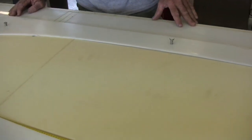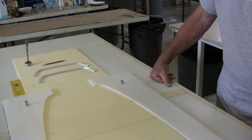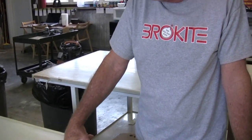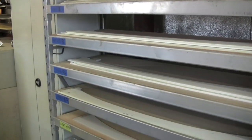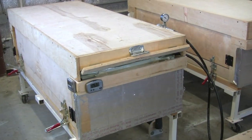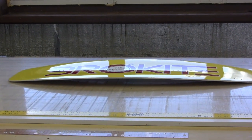This is a pattern table on the board right here. One of the cool things about our technique is that it gives us a great deal of flexibility. We make a lot of different types of boards and we don't have to build super expensive molds. Right now we have 18 boards in our stable. It only takes us about an hour to do a new outline and a new board. And because of our toasters over here — our boxes that we heat things up in — we also have a lot of flexibility in changing rocker and bottom shape.